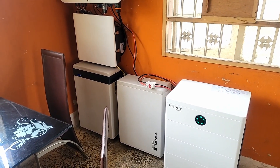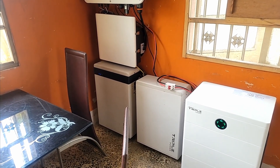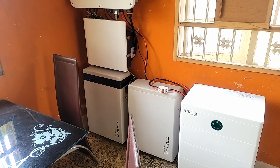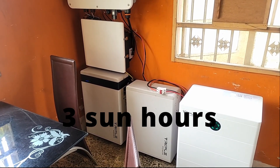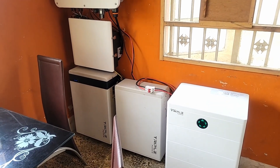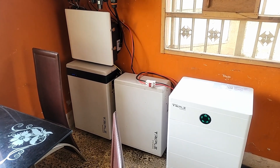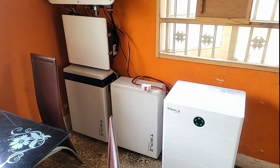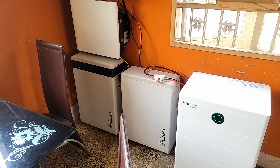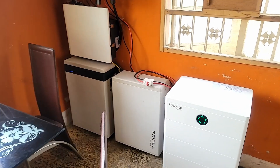What you do is look at how much you consume every day. In my case I consume about 28 kilowatt hours a day — let's round it up to 30 kilowatt hours for ease of calculation. I'm 100% off the grid, so for off-grid calculations I use three to three and a half sun hours. So 30 kilowatt hours divided by three hours means I need 10 kilowatts in panels to produce the energy I consume daily and recharge my batteries.